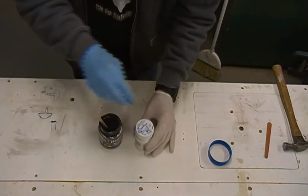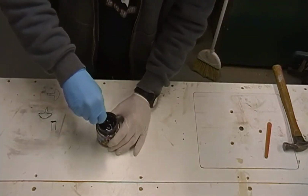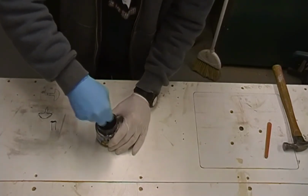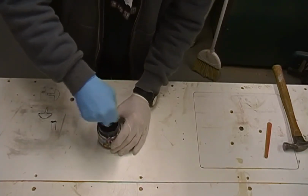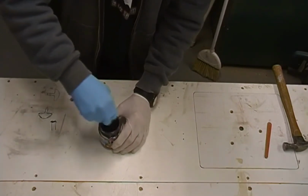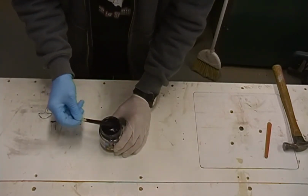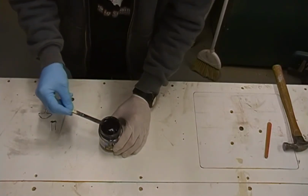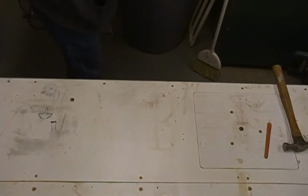Okay, so the other thing I'm going to do when I'm applying this is work in smaller areas and work it until it's pretty dry, so that it just pushes down. It'll go into the pores when it's wet, and I'll just try to smear it around until it's drier, and then move on to another section. Even though this isn't bad sanding, I don't want to do this another time past this. I'd really like this just to get in there and be done with. And if I thought one pass, leaving more on the body and sanding back down to the surface would give it to me in one shot, I would just sand a little more. But yeah, that's still going to dry, I think, a little gray, but it's got some red background to it now.